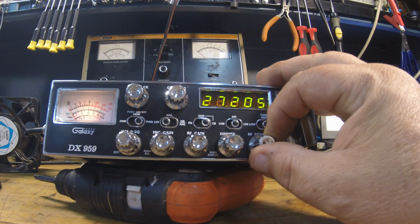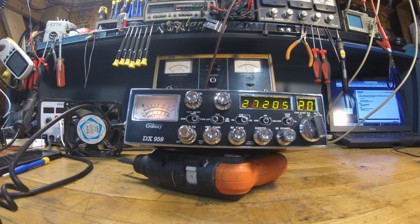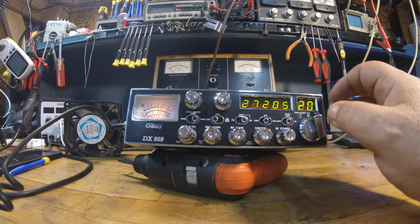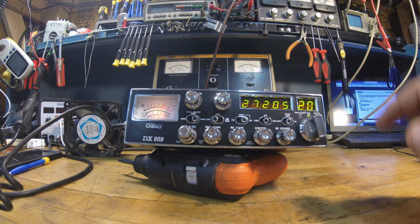Let's go ahead and do our power to 12 o'clock position, which gives us about a 6 watt dead key, 7 watt dead key. PDC showing that. We're on the 50 watt scale. A little cheap there, not sure why. But my PDC showing about 15. Same with the power meter here, which I set the two together. And then we're going to go max power here, which is about 10 watts. Right at 10 watts. I'm at the 50 watt scale there. 10 watts.